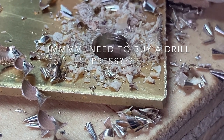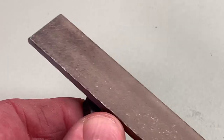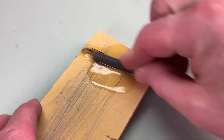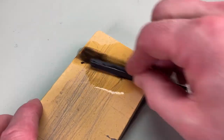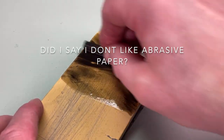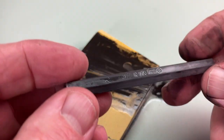So there we are — we've got our across-flats size drilled in our sheet of brass, and it's time to go back to our Allen key. It's now cooled down. I'm just going to tidy up the end with a file, and I want to tidy up the surfaces or flats to remove any oxide. So I take a 1000 grit ceramic stone because I don't want any rounding. Don't use abrasive paper — abrasive paper really isn't of any interest to me in new making because it almost inevitably causes rounding. One of the foundation stones of horological manufacture is crisp angular detail; this is why I really don't like abrasive paper. So I'm using this abrasive stone, which is much flatter, and then do a few calculations.